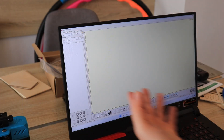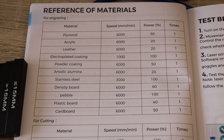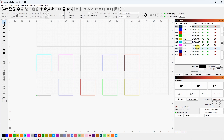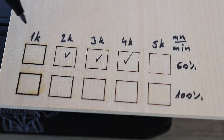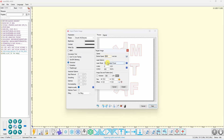From the software side I will use both options. LaserGRBL is a free software available only for Windows but can only do one type of operation at a time. LightBurn is more advanced software available for Mac and Linux too, and you can combine different speeds and power in one operation. Very useful is the included table with recommended parameters, which looks accurate — one part for engraving and one part for cutting. Starting with engraving — here you can see my parameters in LightBurn, and this part is sped up 4 times. At 3000mm per minute and 60% power it looks best. Next I am engraving a logo using LaserGRBL — you can see my settings there.